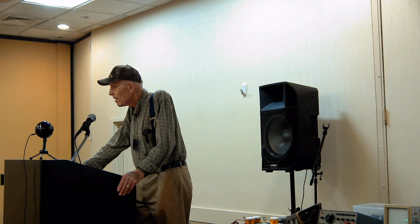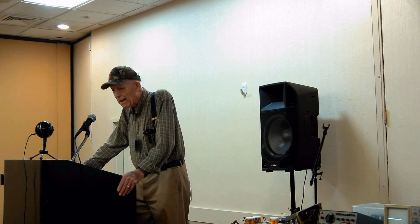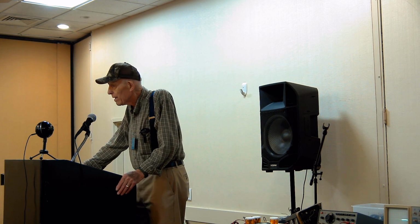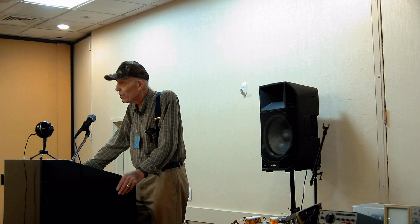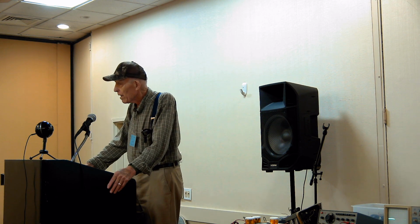Yes. I picked up a dual trace scope, but it only had one probe, so I've got to get a matching probe. Is there any way to tell what the impedance of the probe I have is? What brand is it? It's an HP. Yeah. You can use any HP scope probe, or you can use a Tektronix probe. The reading might be very slightly off, but it'll be essentially the same. Now, the HP probe is sometimes a much longer cord. I don't know, is yours real long?